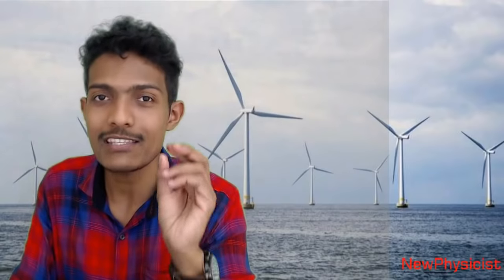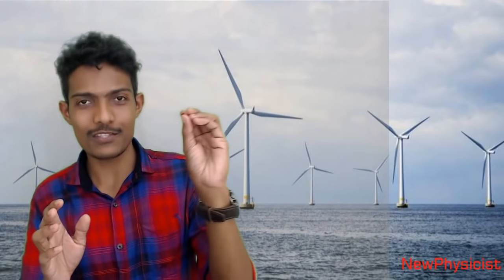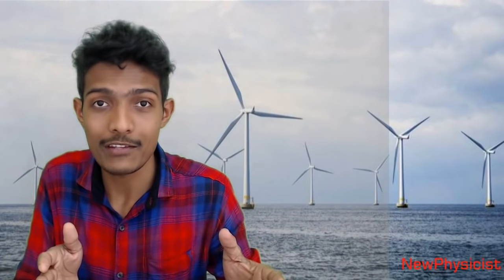There is a small wind direction measuring instrument on top of modern wind turbines, but it is not big enough to get noticed. That's why you can't see a tail behind it. But there is this wind direction mechanism on top of the turbine casing, which will measure from which direction the wind is blowing, and it will send a signal to the electronic system to tell the yawing mechanism which direction to